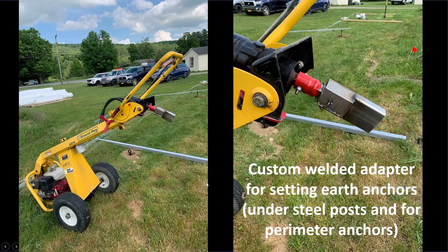The adapter really worked out. It is smart to have some sort of locking hole — the output shaft has a hole for a locking pin. So putting a hole in this adapter is important. We just did what we could on the fly and put a little bit of wire through it, but something better than that would be great. Something to lock it in place.